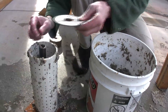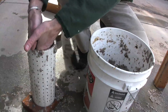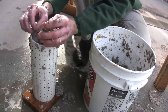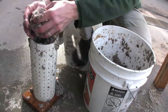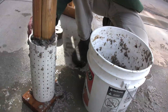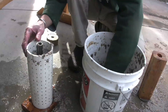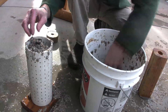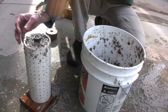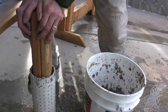Then I'll take this ring, which is a separator ring, which allows me to make more than one briquette. I'll push it down — you can see the water coming out of the holes as the material compresses — and then I'll load it up again. Usually you'll have a team of about six people doing this and they can really make some headway working together, because one person's preparing the biomass and another person's preparing a cylinder. A good team can produce about 500 briquettes a day. The average person uses about three briquettes per day in a family cooking situation.